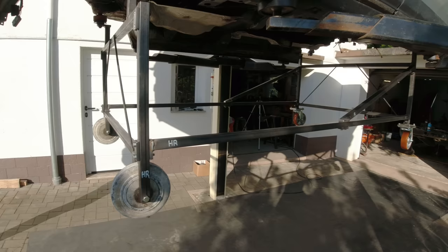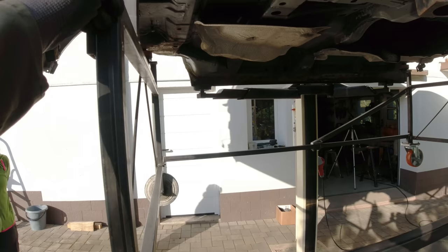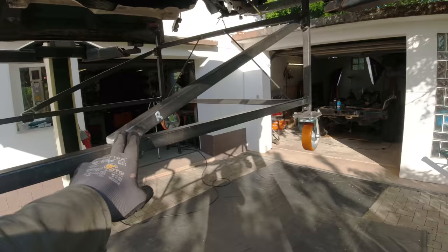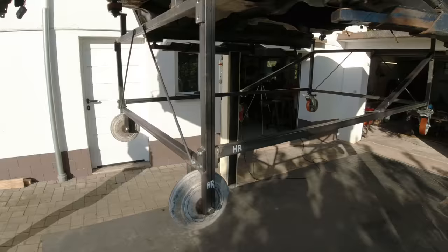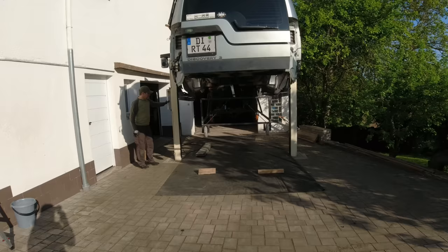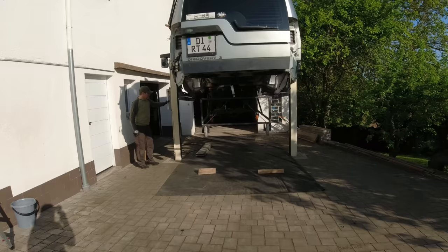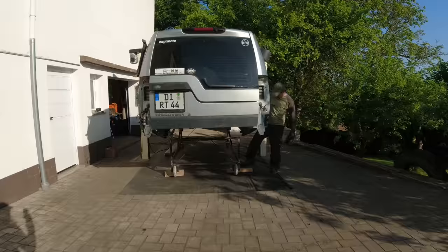We're going to have to stop having off-camera discussions about the stability of this thing. This is 30 by 30 millimeter, 2.5 millimeter wall tubing. These are M8 bolts. The entire structure is fastened on four points to the body. It is reinforced here so it doesn't tilt over. The structure is absolutely solid — there is no more off-camera discussion now. It's going to last. Our driveway is in a slight angle. Now it's shortly above ground — we're going to make sure it doesn't slip forward right here. And now we're going to risk it.